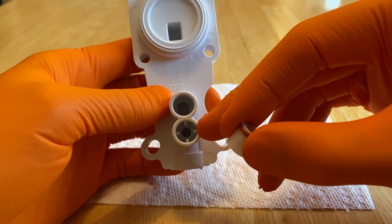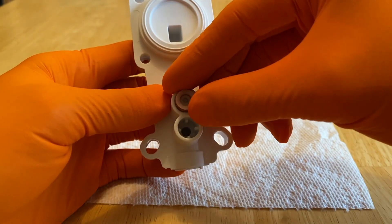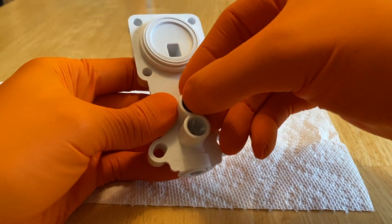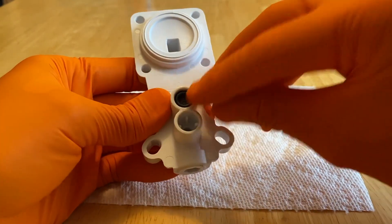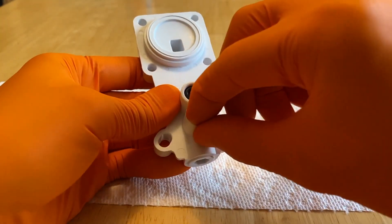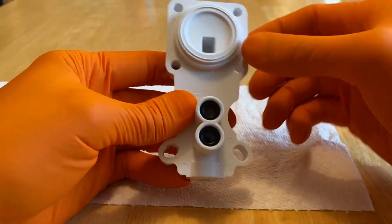You will notice the difference between the lower insert design — it's got those four prongs or teeth sticking out — and the check valve goes on the top. Push it in, and I will then insert the o-ring and push it in as well. I'll grab the lower o-ring and push that down flush with the four inner teeth.